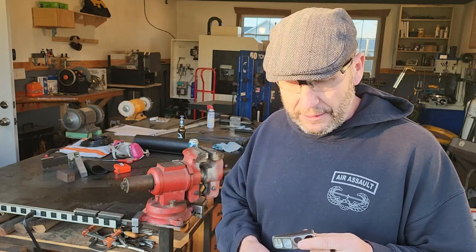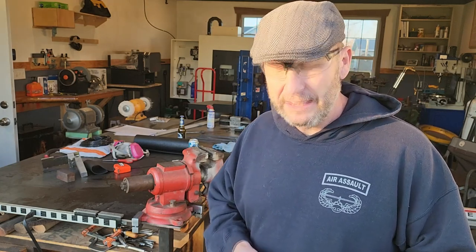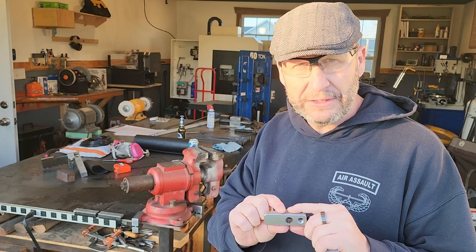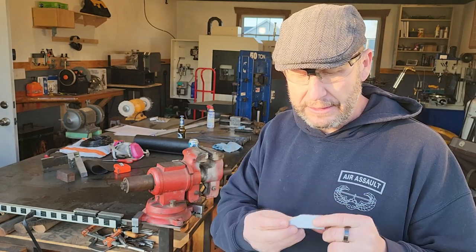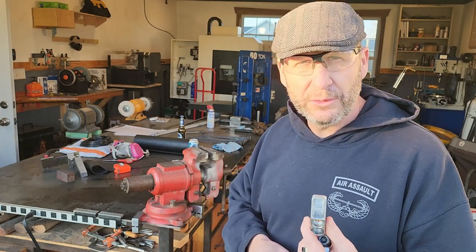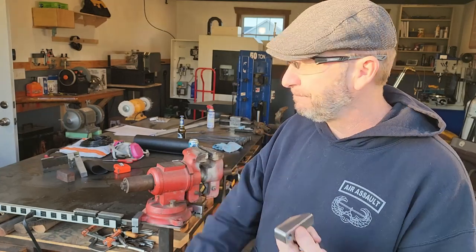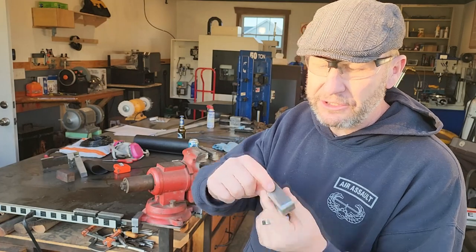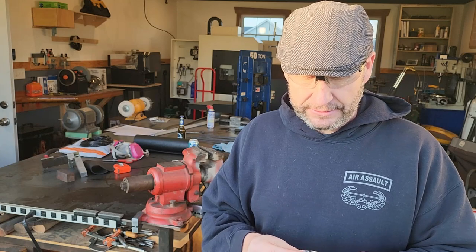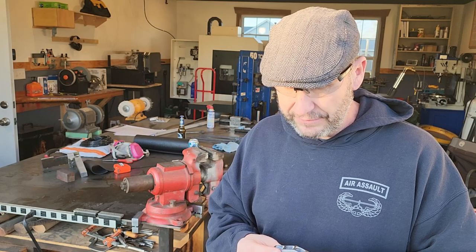All right. One other thing that I learned is my probing is most definitely off in the Y. This was 25.4 millimeters wide material, and the part is only 22 or 23. I wanted to be able to take this carburization off all sides, and it's still on this side. This is the side closest to me. So yeah, I need to recalibrate the probe from start to finish, just go through everything.